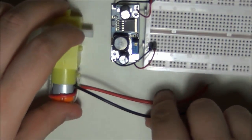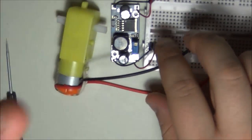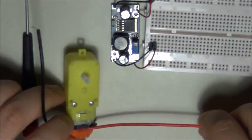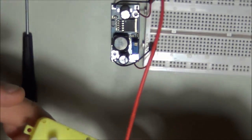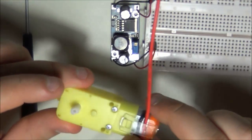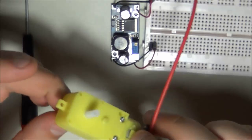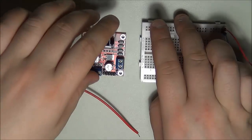You can already imagine controlling this with a PWM output from your Arduino. One important thing to watch out for: the Arduino is unable to source 1.2 amps of current, which this motor requires even on an empty gearbox — even more under load. You cannot simply connect your PWM pin from the Arduino directly to this motor or you will fry the Arduino.